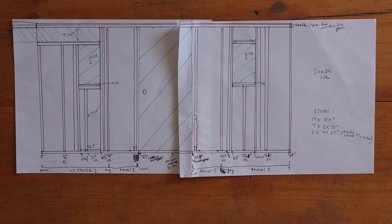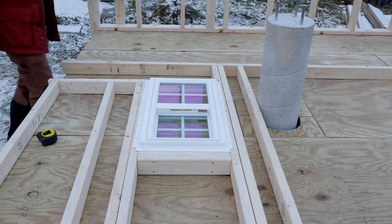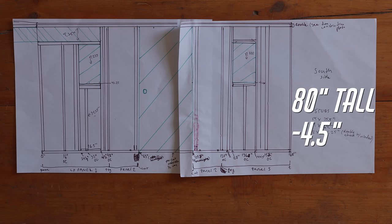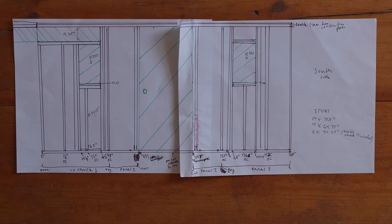With the roof trusses done, I can now move on to framing the walls. I'm using pretty standard two-by-four framing, spacing out the studs 16 inches on center, with extra framing where you have windows and doors. I want my finished walls to be six feet, eight inches tall. You subtract four and a half inches for a single bottom plate and a double top plate, which gives you a stud length of 75 and a half inches for six-foot-eight-inch walls. But I'm not cutting all the studs to that length because to make the roof roll off, we need an extension with beams coming into the walls. On the side that the roof rolls off, I'm leaving a gap in the top of the framing for a double two-by-ten beam. For those studs, we remove another nine and a quarter inches.